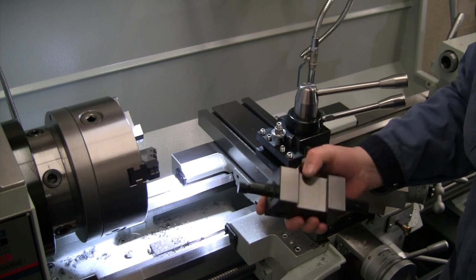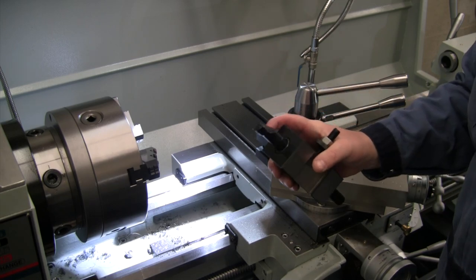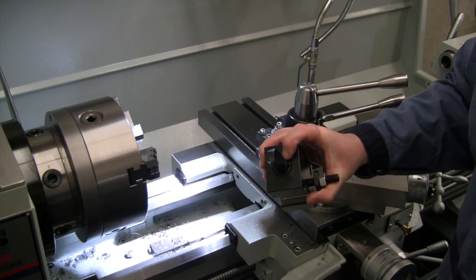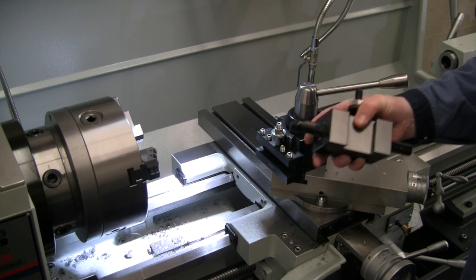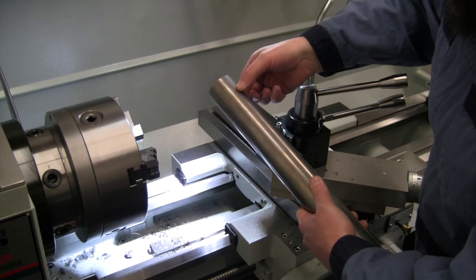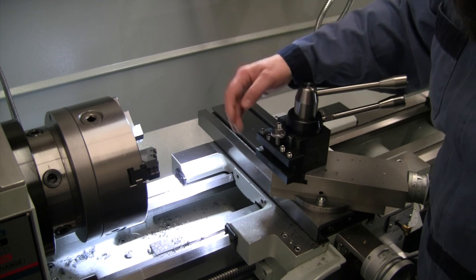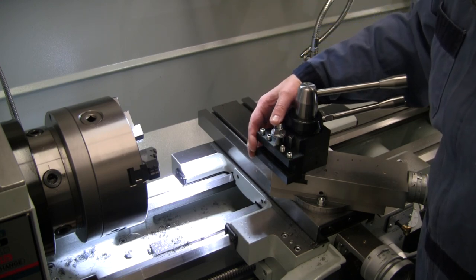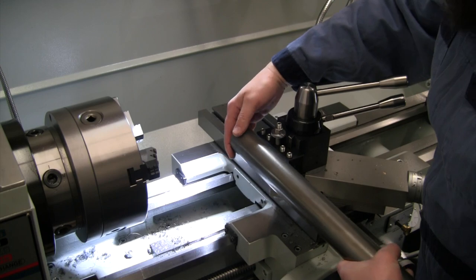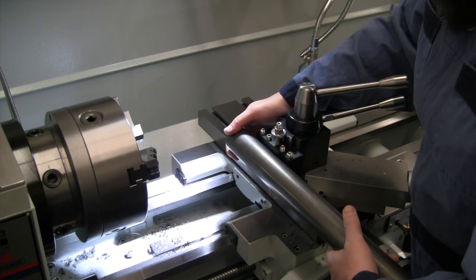Currently our largest boring bar is three-quarters of an inch in diameter, and it's in this larger tool holder right here — fits on the quick change tool post. I'm not going to machine a tool holder to hold an inch and a half. My plan is I'm just going to mill flats down on here to fit into one of these existing quick change tool holders, so I can still take it on and off, set it on center, and have repeatability. We're going to mill those slots long enough that we have about three inches of adjustment to move this back and forth.